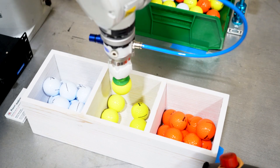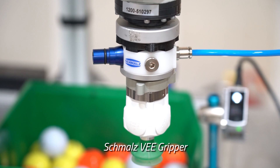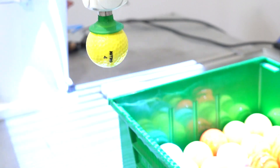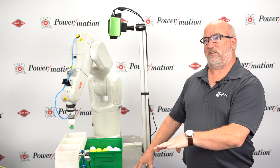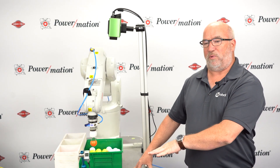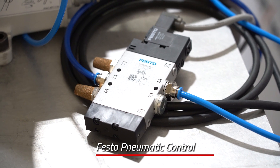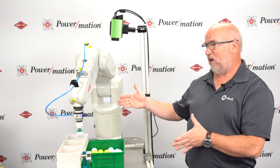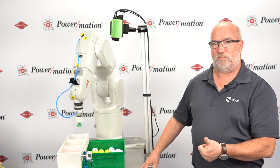You are able to set up and pick your tooling and your pick point. You can have multiple pick points on the same object depending on how the object might lay in the bin. If the object is laying differently, you might be able to use a different tool or a different orientation. By setting up the bin and the tools, we also have the ability to ensure that the tool, the robot, and anything else does not collide with the bin — collision detection is built right in as well.